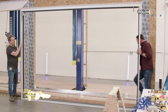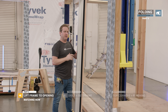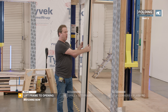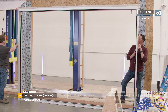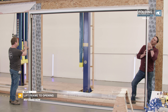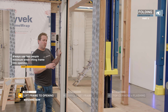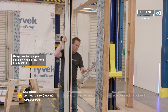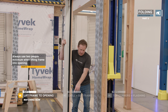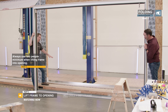What we're going to do is tip it at a 45 and then just stand it in. As we stand it in, you hold the nail fin back like this and have it sit over the top of the sealant bead. You put the nose of your sill at the front and ease it into the bed of sealant.